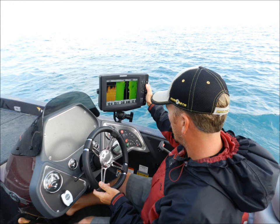But people are pretty confused on how it works. Traditionally, we've all been used to and grown accustomed to the way that 2D traditional down-looking sonar works — what kind of returns we're getting and what's under the boat versus what we're seeing. And side imaging is totally different. Traditional sonar sends a cone-shaped signal down, and when that signal is interrupted, it interprets what's underneath your boat in that cone.